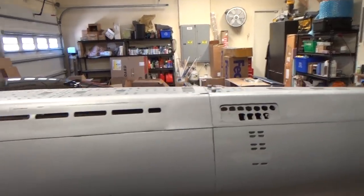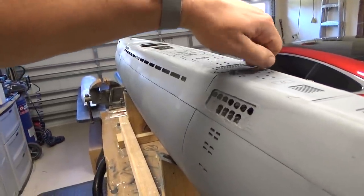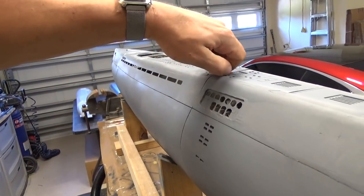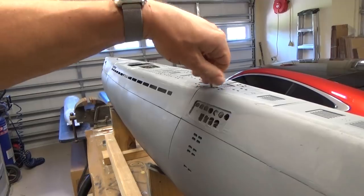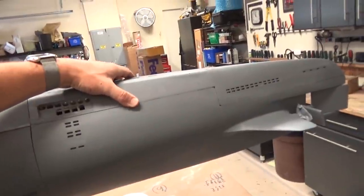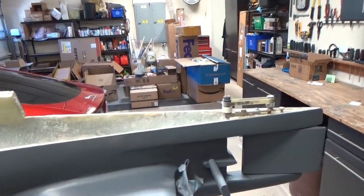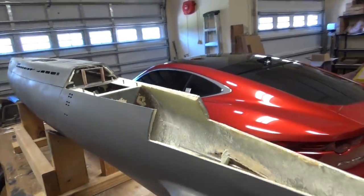For access, there are three bolts — basically thumb screws, stainless steel. You don't need any tools to get into this boat. So if you bear with me I'll remove these and remove the rear section to show you what that is starting to look like, and then how the rest of the upper deck removes. Basically this section here just slides aft and lifts up. In the back you've got a little brass u-channel that fits over a stainless steel bolt back here, and with it securing in the front everything gets locked down nice and easy.